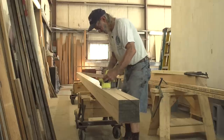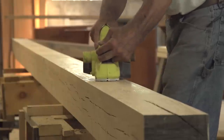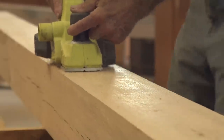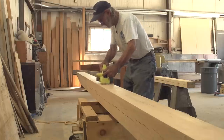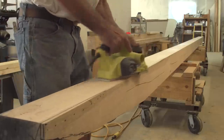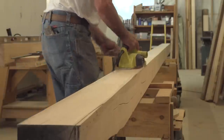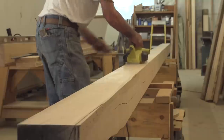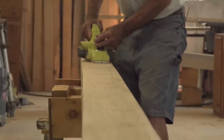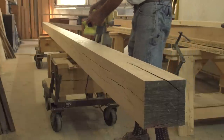This is one nice piece of wood to make a keel out of. It's not real broad like sailboat keels are, but it's a parallel timber - the same dimension across as it is up and down, and it's quarter-sawn. That's what I did at the mill, to get the annual rings in one direction and the same direction on the other end. Because if you don't, when it shrinks or swells, it becomes what you made square into a rhombus. These timbers are alive, actually - they move, swell, contract, set, bend, twist, everything.